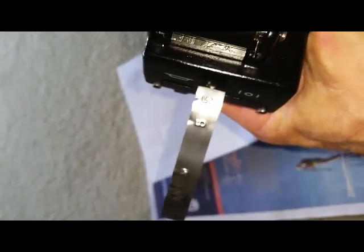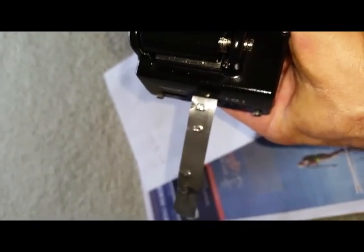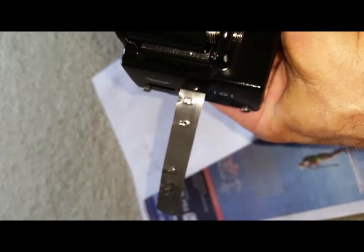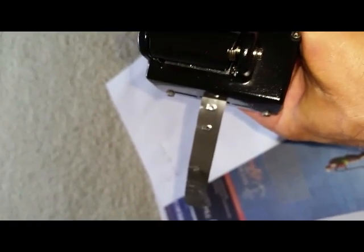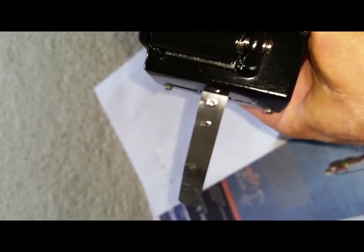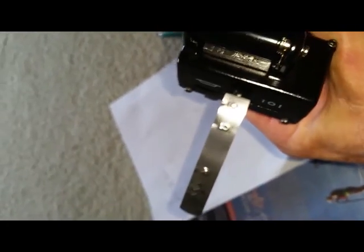Okay, here's my two numbers. I don't know if you can see it too well, but the first one looks pretty good, pretty legible. The second one, like I said, was a half a turn or 180 degrees, turning the knob clockwise. And it doesn't look that much better, but it did raise it up enough where the clutch wheel would not advance the tape. I actually had to pull on this side of the tape to get the raises past the numbers, because it slides in between the wheels if you inspect it carefully.